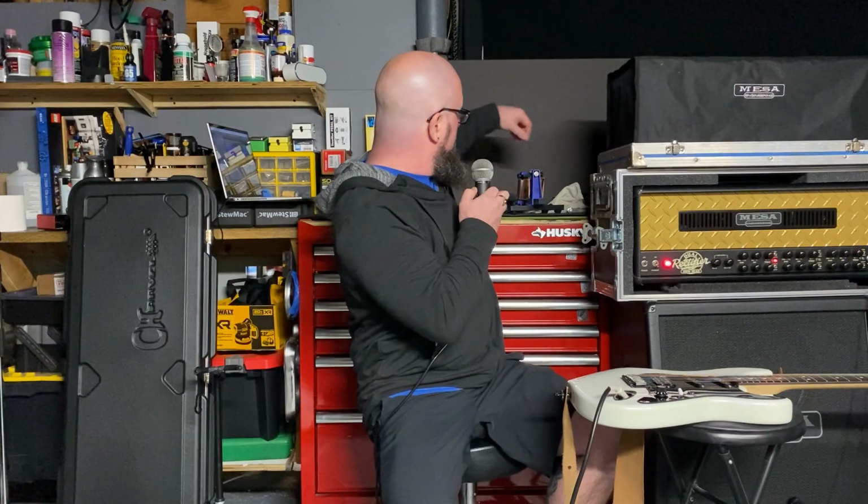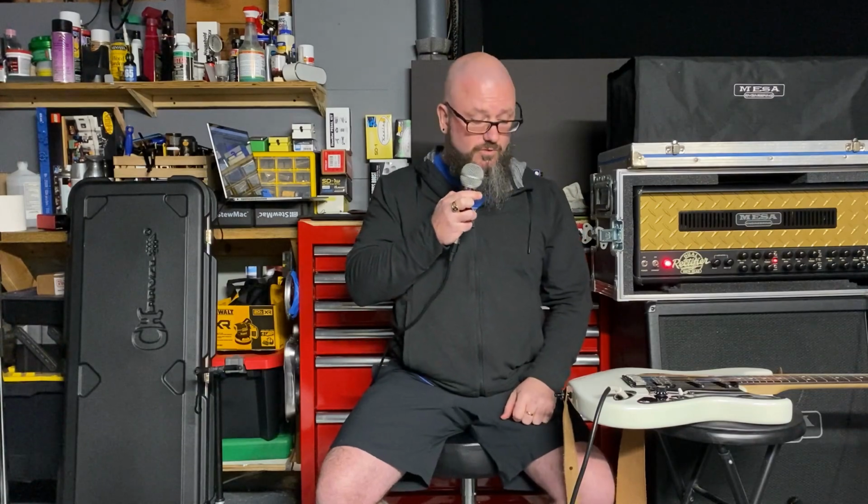The hardest part about it is one of the power terminals. You will have to connect one of your leads from your switch to that. And it's a real pain in the rear end on the newer Crybabies. The signal trace likes to lift from the board. So, just be really careful with your soldering iron on that. You'll find out the hard way like I did, and you'll have to repair a signal trace. So, sounds good. Works pretty well.